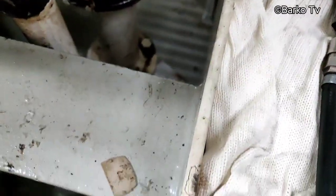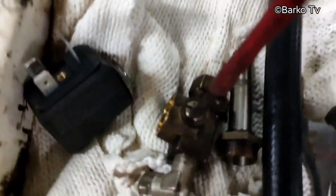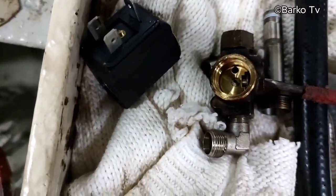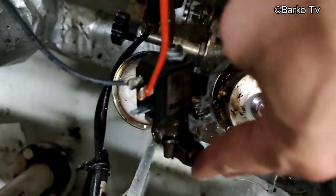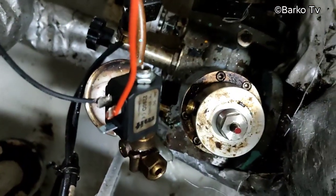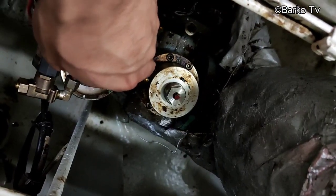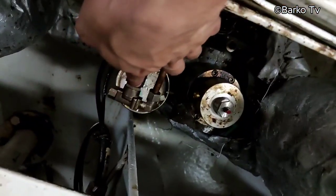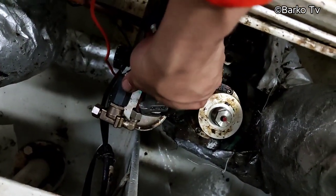And then after cleaning all parts, that is the manual operating valve for this pilot solenoid. Then the pilot solenoid is normal, and then we check again, activate by power supply. You can see there is also, I checked manually using an air gun, and you can see the valve is open and closed. The main valve is open and closed.